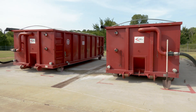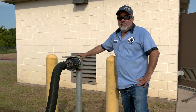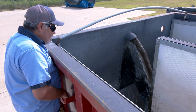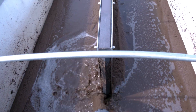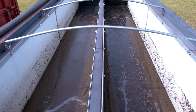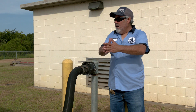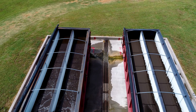Now we're at our drying boxes. This is where our mixture of waste activated sludge, polymer, and water comes in. From here they go into the boxes where they actually dewater and dry — that's our final stage. In the drying box itself you've got a fine white mesh on each wall and one in the center column. Once you're pumping in, the waste compacts and you have a supernatant up on top.